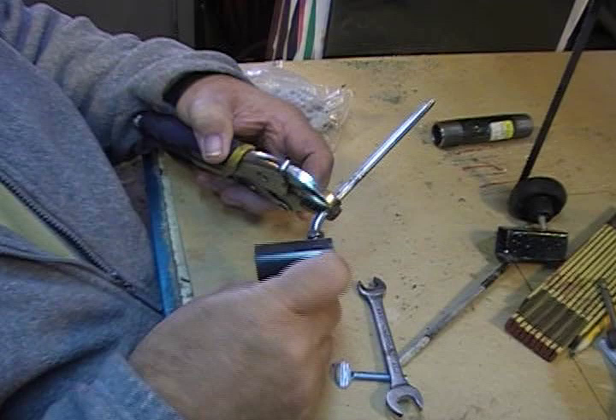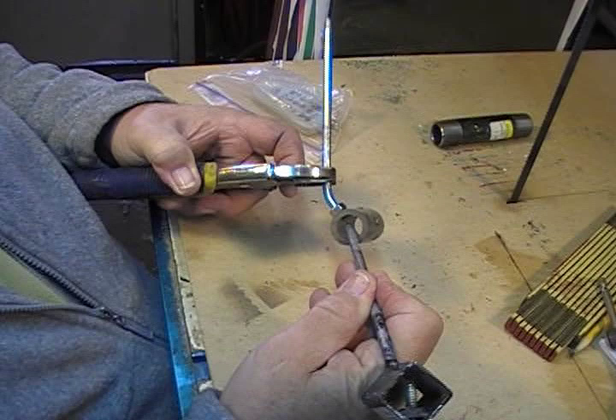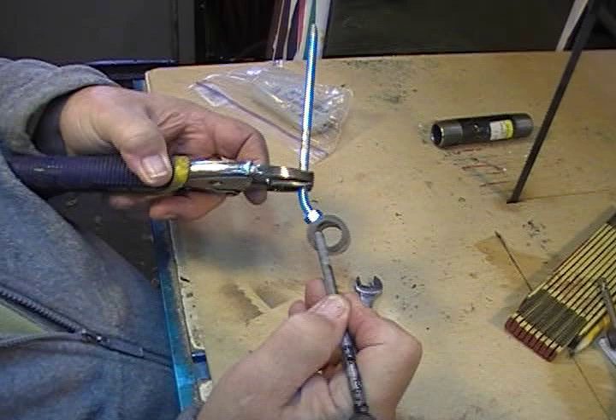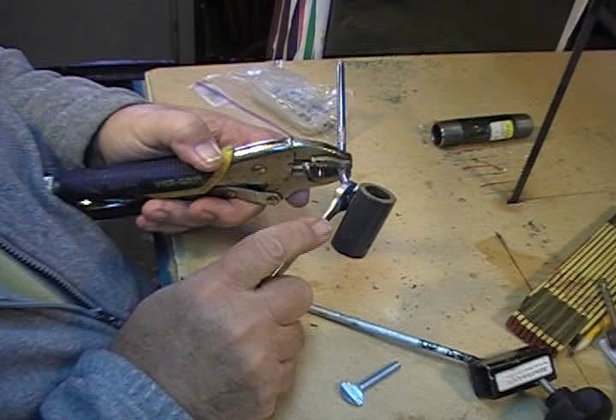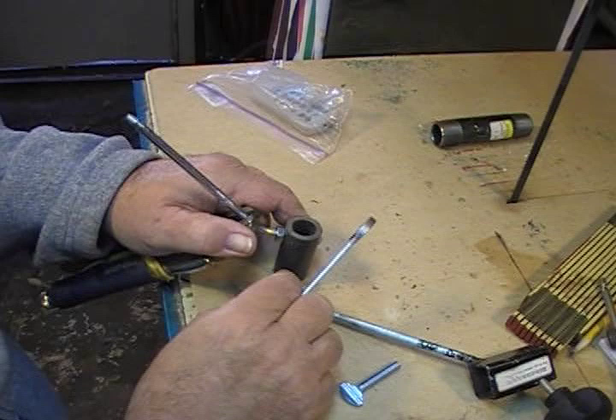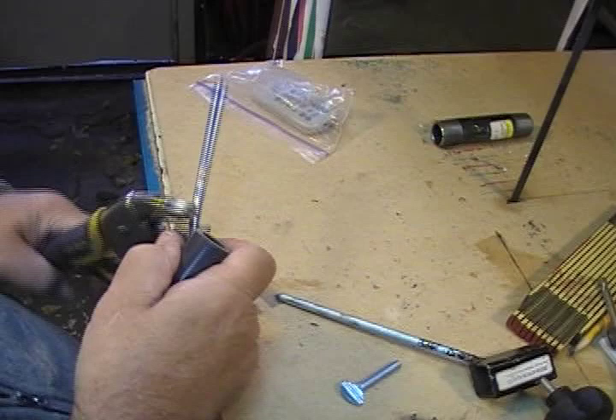When you thread your coupling on, you're going to have a jam nut. Note: inside, that rod cannot come higher than the inside surface of the nipple. If it does, it'll hold your gouge up away from the bottom — you don't want that to happen. Get another little half turn, then I'll take my 7/16ths and snug up my jam nut. You can't go real tight, but get it snug. What I don't show you here, but what I did, was put some super glue around that to prevent vibration and keep it from coming undone. Now this part of the jig is done.